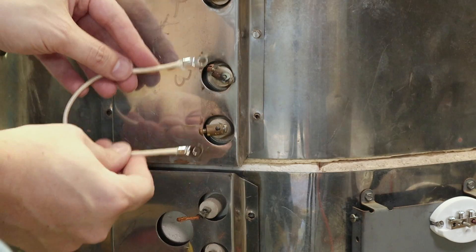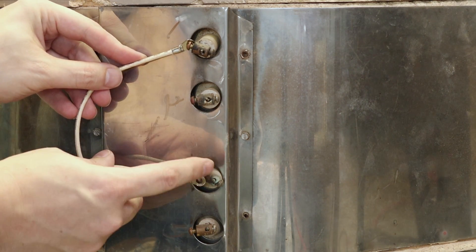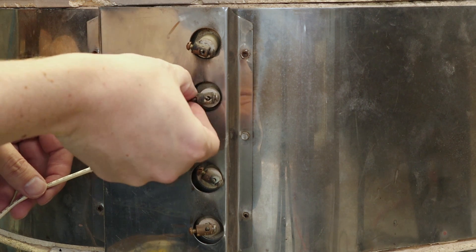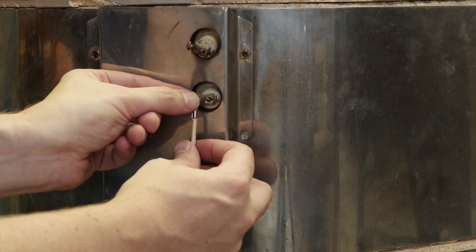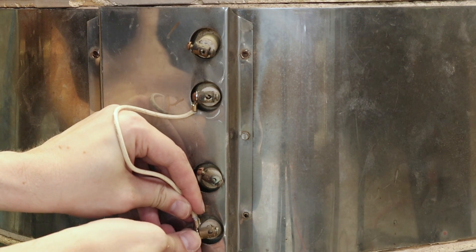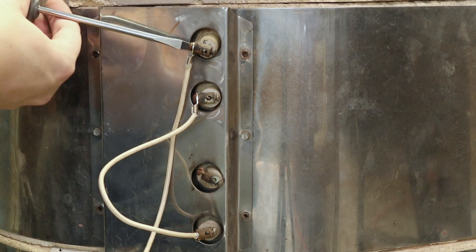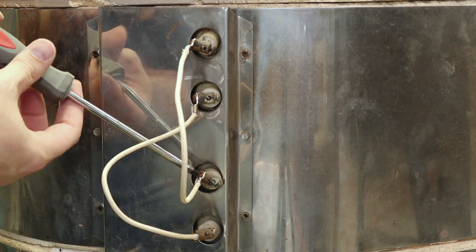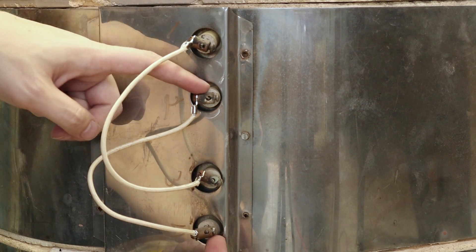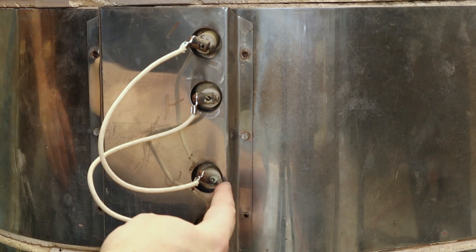So there's one wire with terminals done — I need to make a second one. To wire these elements in parallel: one wire connects these terminals, then there's a wire going out to the relay, and another wire connecting the other pair of terminals, with another wire going out to the relay. So now one end of both elements is connected together and the other end of both elements is connected together — they're in parallel. I didn't cinch these down yet since I don't have power coming in; I'll need to add more wires.